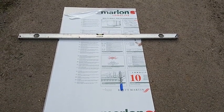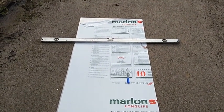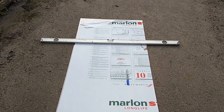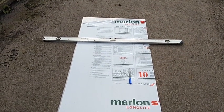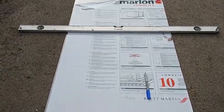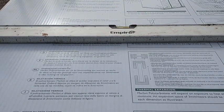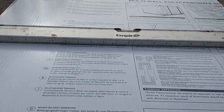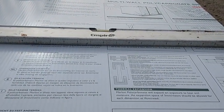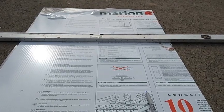we're going to be putting the side windows in, the lifting windows, to vent the polytunnel, and I've measured that in inches, the imperial inches, and it's exactly 2 feet wide. So what I want is 1 foot wide lifters to vent, and so in order to do that, spirit level there, the 0 point, I work out from that side 12 inches, and that side 12 inches, and then mark the 0 point, and that gives us our midpoint to do the cut. So I'll crack on with that and cut that in half.